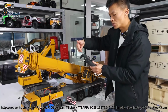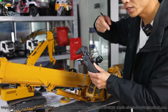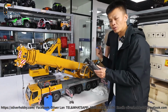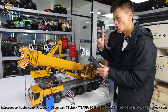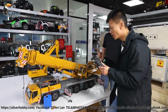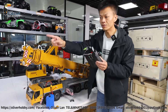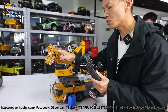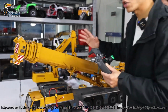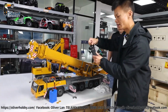We take the withdraw back procedure, SWE, backward. If the pump doesn't start and there is no reaction, it means the withdraw back procedure is already finished. So you test only for a short time, pushing forward to hear if the pump starts and if it starts moving. If after 1 or 2 seconds this one is not moving, it's not correct. You have to stop, otherwise it's always pushing the cover, causing damage. Let's try. Pushing forward.